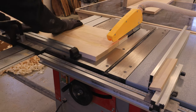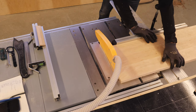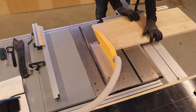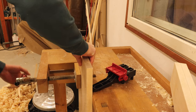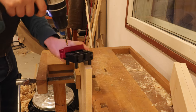Once all three panels were ready, I started to cut them to size on the table saw for the first table. Then, on the next day, I started to make the joinery for the build, and like on many of the previous projects, on this one as well I will be using dowels. I started drilling the holes with a doweling jig to the ends and edges of the pieces before moving on to make the corresponding holes.